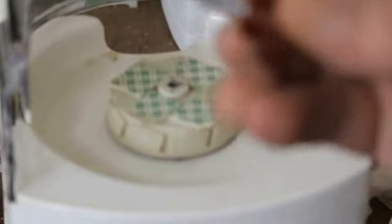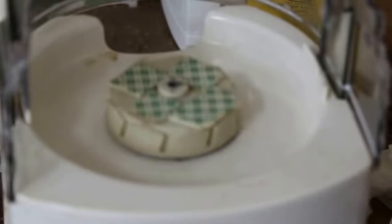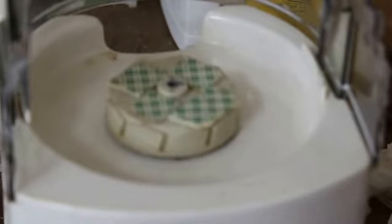And I had this little knob. This little guy here, sorry, that's unfocused, but I had this from part of a woodworking machine that I had made, a router table, and it was for a fence, and I bought a couple extra ones, so I had that laying around. It's 1/4-20. I had to cut a little bit off the end, so it didn't go down and hit the shaft and lift up the disc here. So this is kind of makeshift right now. Well, the whole thing is makeshift, but I just got this little Teflon washer, and that's just to build up the height so it can press down on a disc.